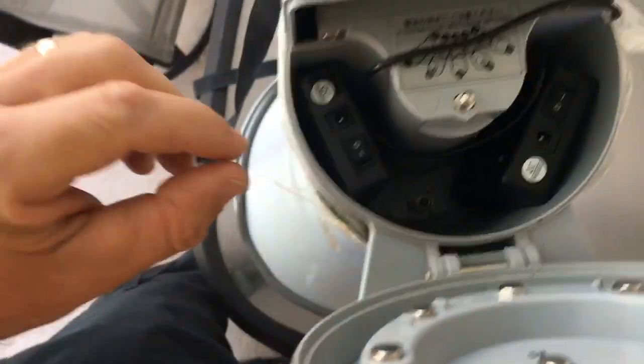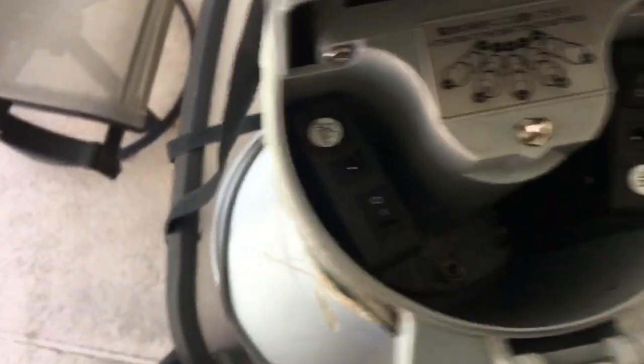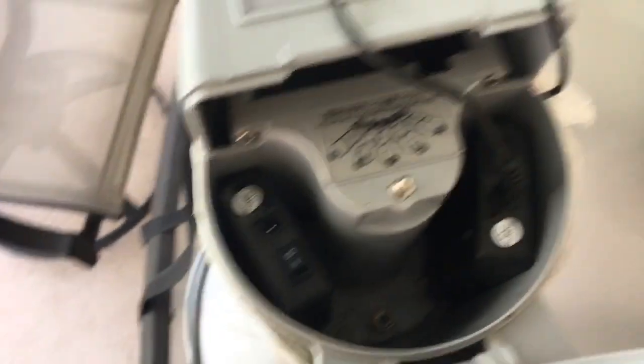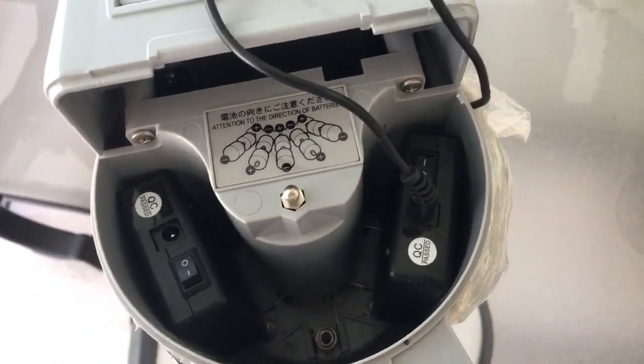I'm going to actually show you how I set up my megaphone here. We've got my Toa megaphone, and inside the battery compartment — let me turn the camera around — you see we've got these two on the outside, and then I just slide another one on the inside. They fit really tight; you actually have to kind of force them in, but they work great. They sit down on top of the springs and just hang out in the compartment, and you run this external cord from your power cell to the outside of the bullhorn where you've got an external power hookup.